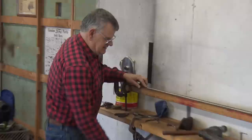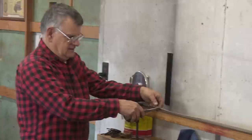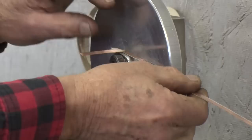This one we're going to wind to the right, okay? So what is different about this one is we've got the tape up. What we're going to do is roll the tape over, and make the tab come to the front again at a 45 degree angle. And instead of going on the bottom, again, we're going to keep the tape against the mandrel. So just place it on top, right in the middle, and we'll rotate it the opposite way.